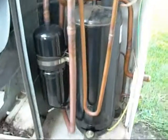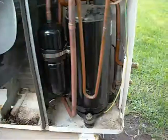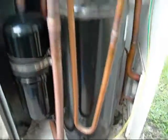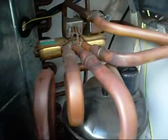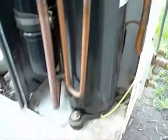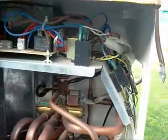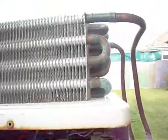I was toying with the idea of using this condensing unit as a compressor, but since I've replaced a dud start capacitor, it runs too well, so I think I might actually use this as a heating unit. It's reverse cycle obviously, still got a full charge of gas in it as well, so I can't just go tearing it apart. I don't have the interior evaporator panel for it, but I've got a nice old commercial refrigeration core. Should work okay.